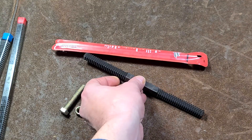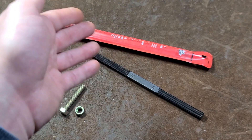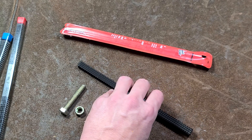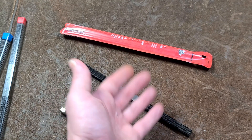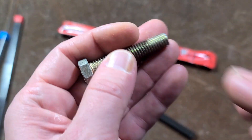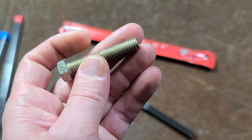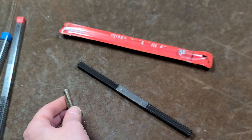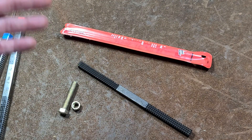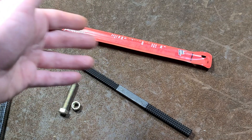Anyway, that's my take on this Vermont American thread file and thread files in general: they're one of those things where even though the idea is great and they generally do work, they are not perfect. Because of the concern of making them a tight fit and actually machining away threads, they add a little extra clearance — and the problem with that extra clearance is it makes it a less effective tool. I really appreciate everybody who's been watching and subscribing. If you haven't subscribed, please do. Until next time, Caddus Maximus out.